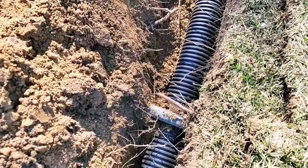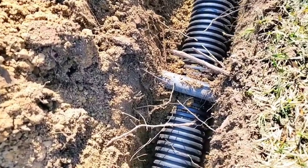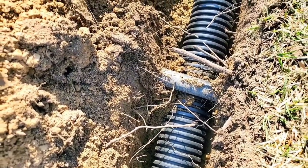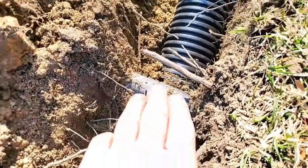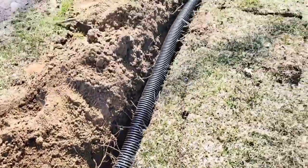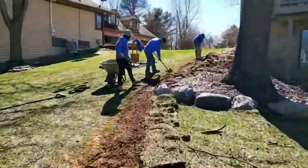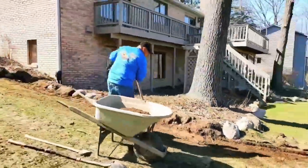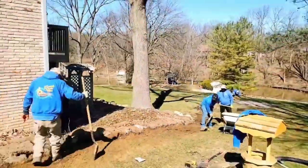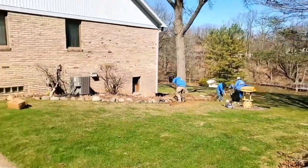Back to that shallow sprinkler line — because we're using three-inch corrugated pipe, we're able to go underneath it. If this was four-inch corrugated pipe or four-inch anything, you'd have a belly right here because you'd have to go so much deeper. A four-inch pipe displaces 56 percent more area, so that line would have had to be cut out and rerouted. If you found any of this information helpful, give us a thumbs up. I'm your host Robert Sherwood — until the next video.